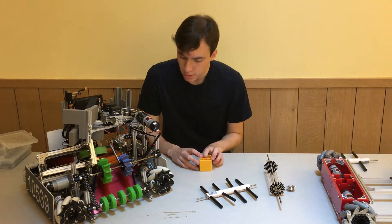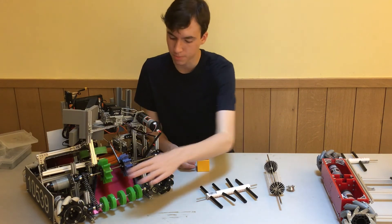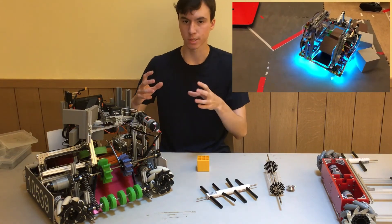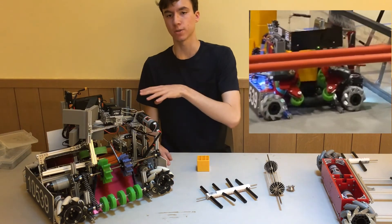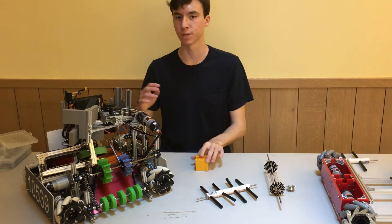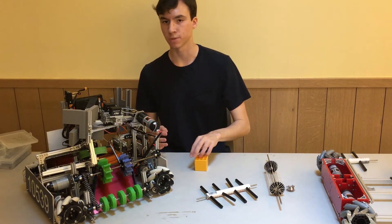We found use for these wheels both in the top-down configuration as well as when they are on the side. In Skystone, we also angled the wheels off a little bit such that they would pull the blocks off the field directly into our storage mechanism very quickly. This eliminated the problem of the ramp and the lift, as the wheels were close enough together to support the weight of the block entirely out of friction.